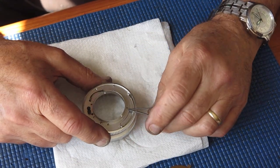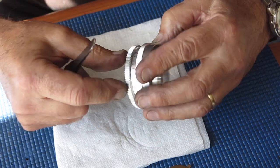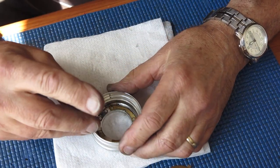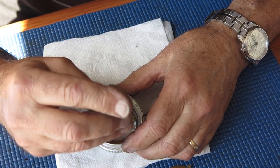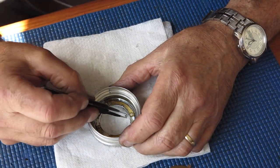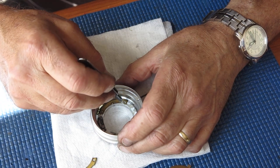You've got to be very careful with these two springs. Sometimes you can lift them off; other times they're reluctant to come off. Don't get them trapped over the centre and then drop them on the bench, because you'll mess the spring up. We have those four screws into those brass brackets — they can come out. This is by no means the stickiest lens I've seen. The grease is quite gooey, but often it's much worse. All that old grease has to be cleaned off and appropriate lubricant put in its place, in appropriate amounts.